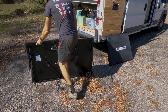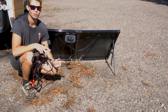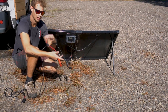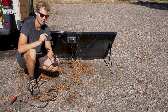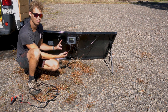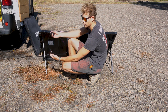We're going to take this and point it towards the sun. I've got it turned around right now because it's a very bright day and it's hard to see in the shadows, but I wanted to show how simple this is. It comes with a 10-foot alligator clamp cable that you can hook directly to a battery. Always make sure this part is hooked up to your battery before you attach the solar panels to the charger — that's very important, you don't want to blow a charger.